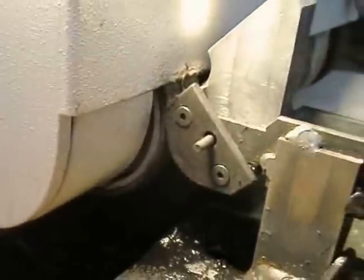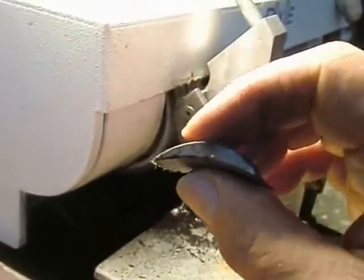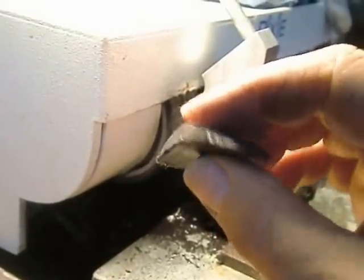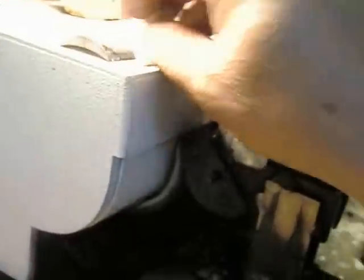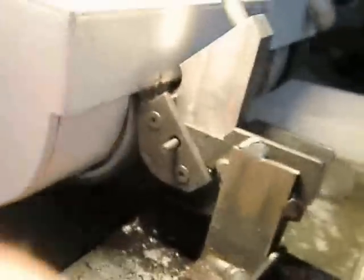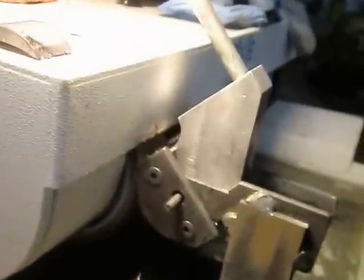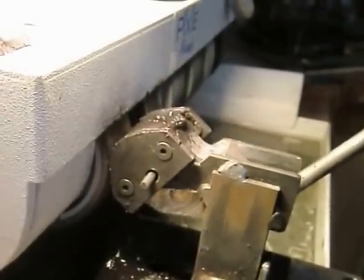The conclusion of this little tool that I've been working on for a week and a half or so is that it's going to create the outside radius of the magnet. Now, this little magnet got broken, so I've got to do another one. But after about an hour's worth of grinding, we can see that the magnet is starting to take shape. I'm going to turn it on. We'll just pull it down, and you can see how the grinder head is matching the radius of the tool and it's cutting that outside one-inch radius.